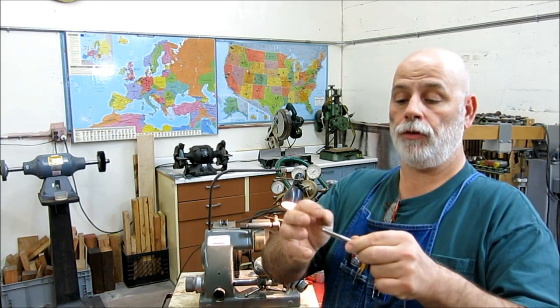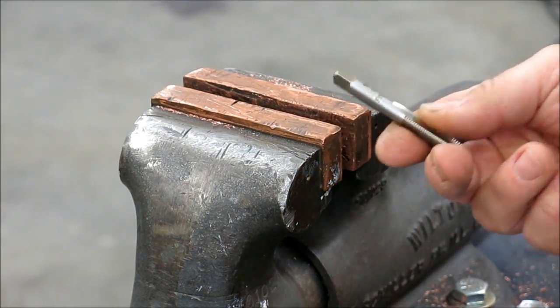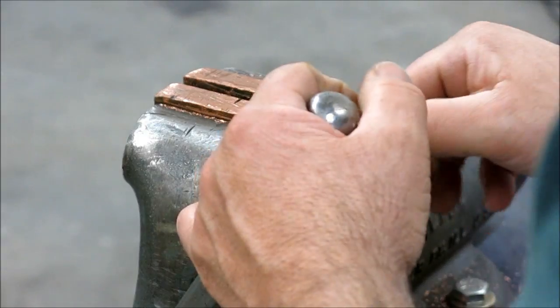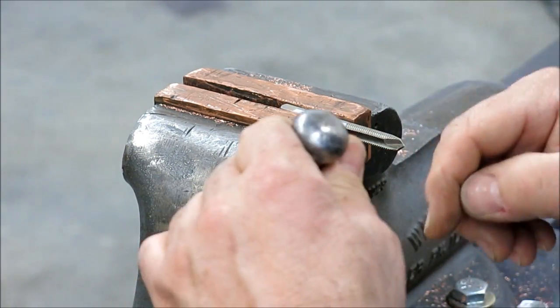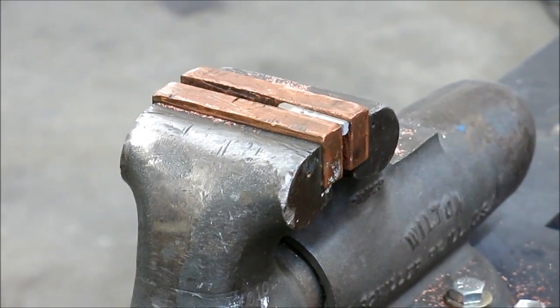First thing I want to do is lose most of the flutes off of this. So I'm going to put it in the vise and snap it off. When you want to break a tap, it's probably really hard to do — hopefully not. So we're going to go ahead and put it in the vise, put the keeper part in, get the last thread right at that interface, tighten the snot out of it, give it a whack and snap that off. And that worked pretty good.